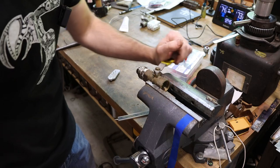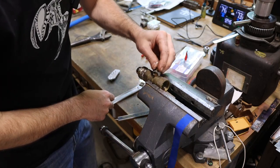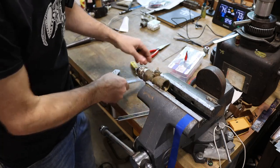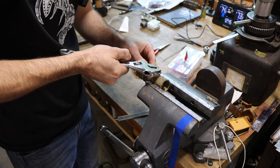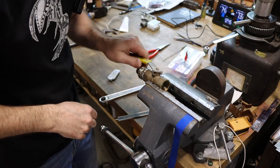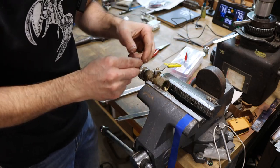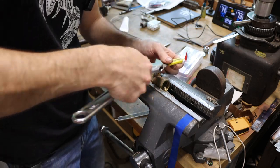So I got the compressed air outlet valve in the vise here, and the handle's kind of loose on it. It's leaking from the stem. So I'm going to see, just finger tight, if I can tighten the stem packing and stop this from leaking from inside the valve out underneath the handle. It's loose. Just going to snug that up a bit. Make sure I don't have it too tight. That's probably okay. And then put the handle back on it. Clean out the threads. Clean the threads on the fitting on the compressor and put it all back together. And hopefully then we'll fix those two leaks.